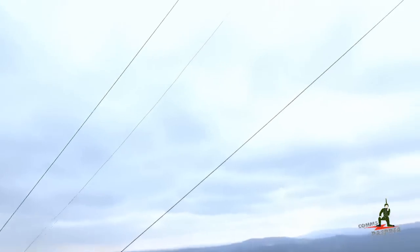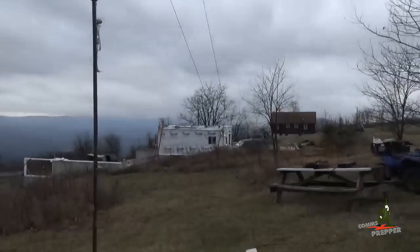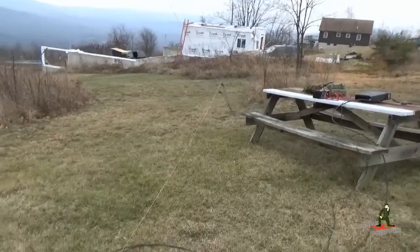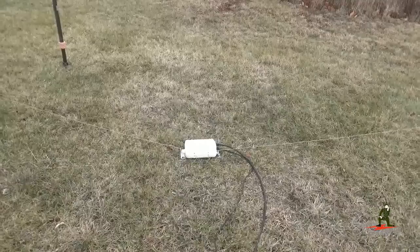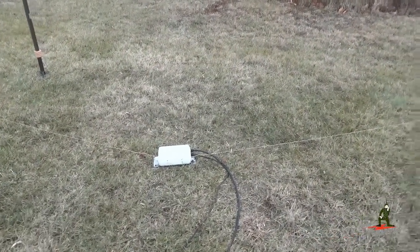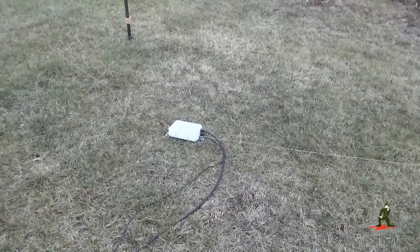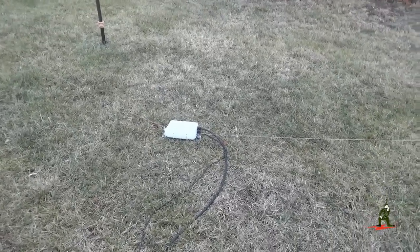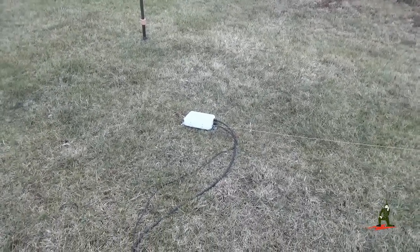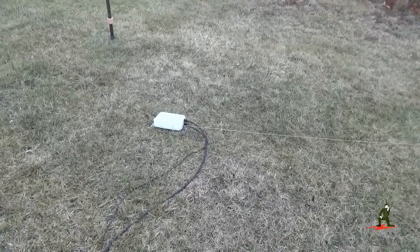The wire runs up to the top of the mast — about 40 feet up — comes right back down the other side to the other guy stake, and then comes out horizontally and connects to the back side of the antenna tuner. So what we have is a single wire that makes a perfect triangle and connects back to the ground post. For DC it is a short, but the advantage of a delta loop in this configuration is if you have to operate in a high noise environment with industrial noise, motors, pumps, and generators — this will help mitigate that noise.